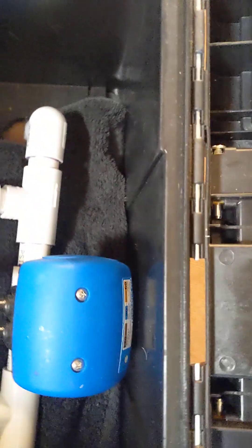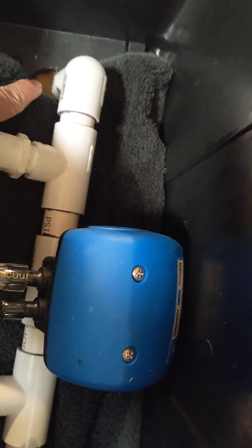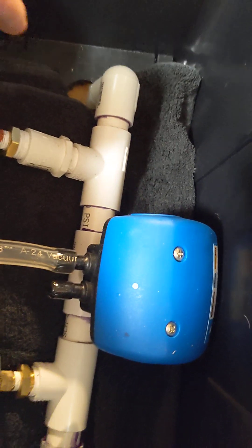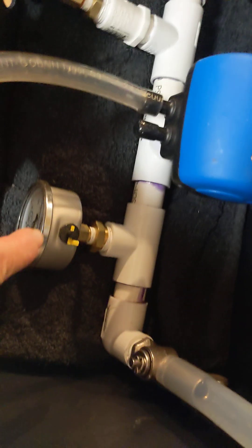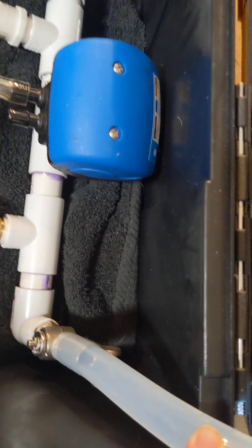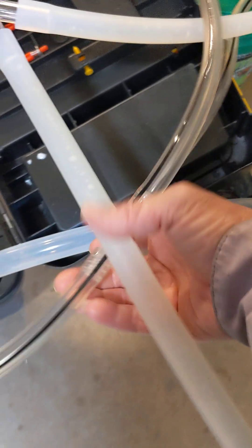That elbow on the far left — Teddy is leaning on me — goes to a silicone tube, which you'll see in the second part of the video. That goes straight down to the vacuum pump. This is the regulator, the pulsator, and the meter. And then this tube goes to the jar. From the milk lines, this goes to the pulsator itself.